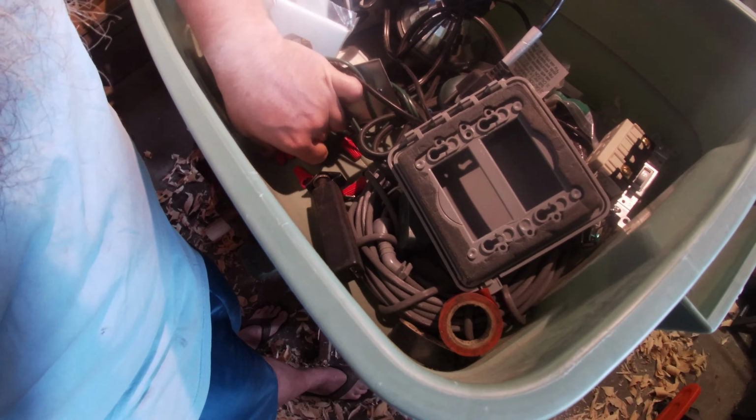Alright, so to get started, I got to verify that the power is turned off. So you'll turn your light switches on, then you'll click off your breaker, which I already have mine labeled. I went through this whole thing since we've lived here. It even turned off this light because the back of the house is all in the same circuit.